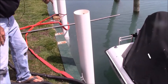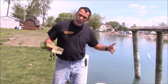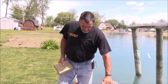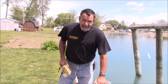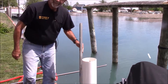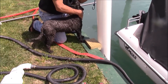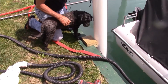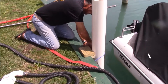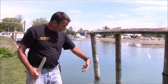They're about an inch below the water line. The earth is going to settle around this piling and stiffen it all up — it might take about 10 days or so. I've leveled it up; I've got a spacer block here so when it sets, my pilings will all be 2 inches from the seawall, which is a good distance. To hold it in place, I simply employ a bungee like that.